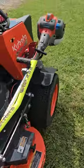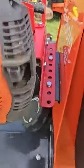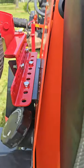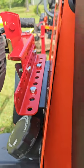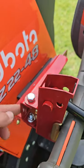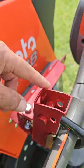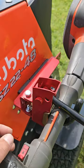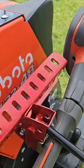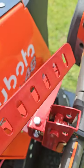For the back, most mowers have a plate that goes over the gas fill, so I used that like a lot of people do and basically just bolted it straight down. That's the mounting bracket. Then there's this bracket — it's the shortest one, it's a U-shape, and it can swivel. You loosen these bolts and it can swivel back and forth so you can line it up how you want. You also have another bracket here. The one I mounted has round holes, and this one has slots, so it's a little more adjustable.